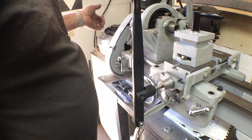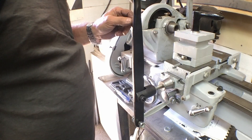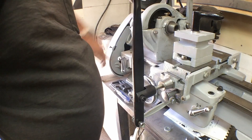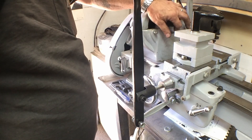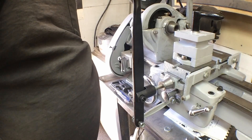From there we will probably move on to the collet closer, because we've got the hand wheel collet closer. I think we'll set it up for 3AT collets. I don't know that I have any 3AT collets in stock — I may have to order a couple just to use the setup fixtures. We'll set up the insert that goes in here; we have to build that yet. And that's where we're at.